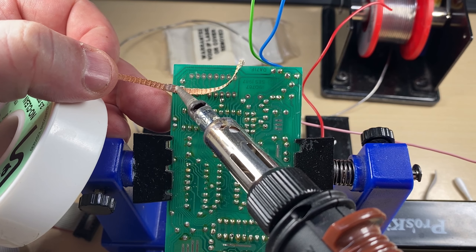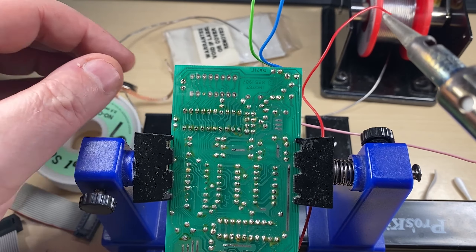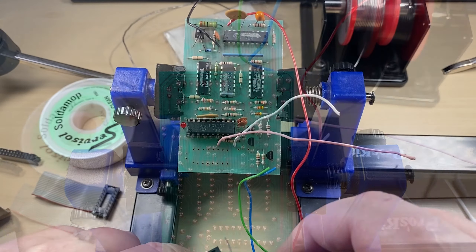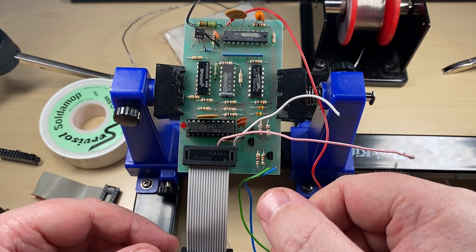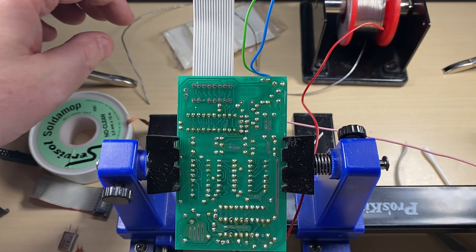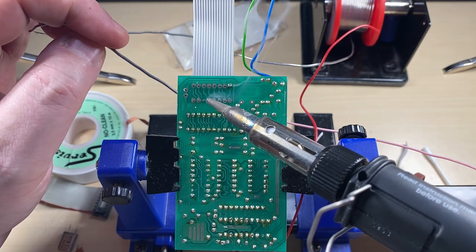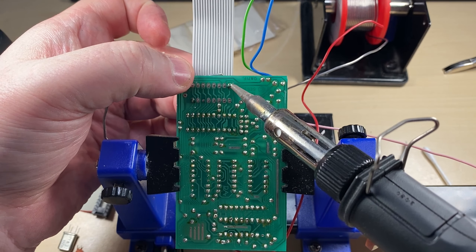Let's have a look at the Tonks board before we put it in the radio. There is the UK40 PLL chip, 10240 crystal, moving up the 4078 and a 4011 logic gates, and what I can presume this one is some form of bipolar PROM - this one seems to do all the magic in the conversion. Under there - I wonder what that could be - it's got a Sanyo and a batch number on it.